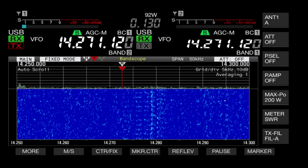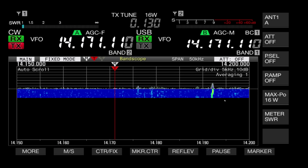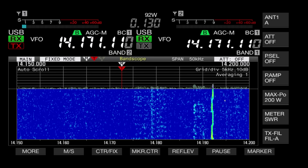14 MHz is a wee bit high — 1.5 to 1 at 14.275. I spend a lot of time at 14.275 and above for the General Class in America, whereas it's actually best tuned at what I call the Russian end, which is 14.170. So I need to take off about an inch — two and a half centimeters — and that will lift it up. But that's the only band I really need to change.